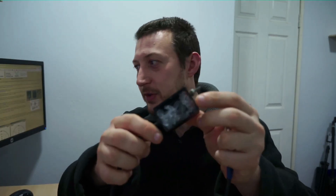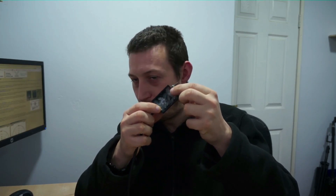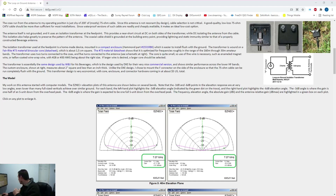So let me show you what I did. This is my little plastic box — two connections on the top. Inside you can just about see the ferrite bead, and I've filled it with hot glue from a glue gun to hold everything in place and stop it moving around. That box goes outside and each end of the loop connects onto it. The winding is two turns on the primary and five to six turns on the secondary — I used six turns on mine.